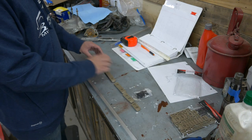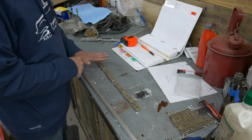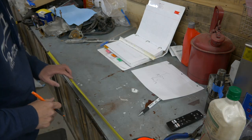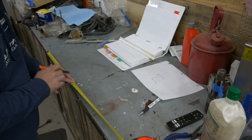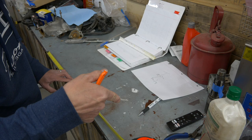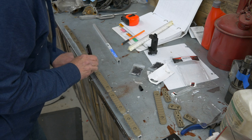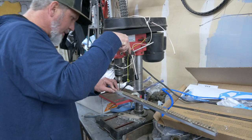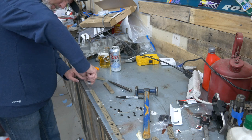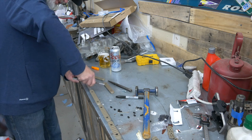After cutting it to 32 inches, I sorted out the Picatinny rail based on how I wanted it to fit, and put gaps between each section to make accessories easy to get on and off. I used the biggest piece in the center, then measured the total distance from the end of that piece to the end of the rail, measured the remaining Picatinny rail length on that side, and divided it out so the gaps would be even. I placed the Picatinny in those spots, marked them, drilled them, and then tapped each hole — rather than using the included T-nuts — so it would be a cleaner fit for the screws going through the Picatinny into the aluminum.